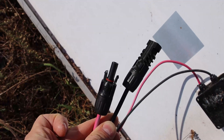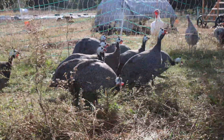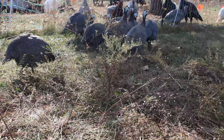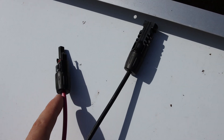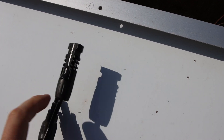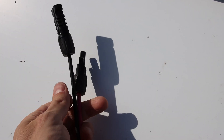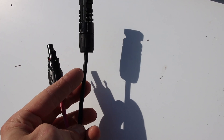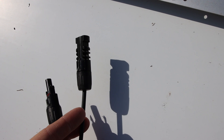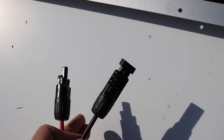I'll show you what I mean. So there are two connector types. Our red is actually a male connector, and our black — our neutral — is a female connector. So these are actually complete opposites, meaning when you wire these together, it's pretty much impossible, unless you are working with un-pigtailed connectors, to screw these up. So if this is your first time playing with panels, do yourself a favor and make sure you are using ones that come with connectors already attached.